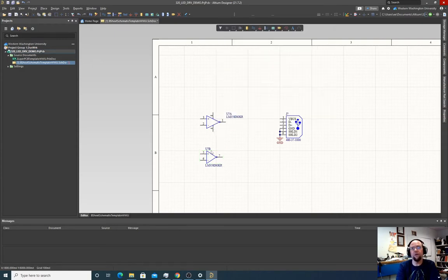And you'll notice this second one doesn't have power pins. The power pins are used here. Some op amps, when you find them, have part A and B, and they will have power pins on both, which is a little confusing because theoretically you could connect two different things. And I don't know what happens, but just don't do that, right? You can't power two op amps on the same physical chip with two separate supplies, at least not with this type of op amp. So we're not going to do that.